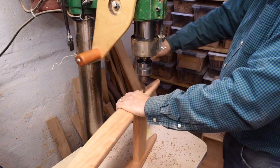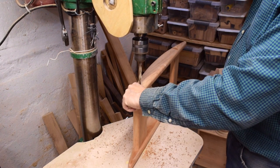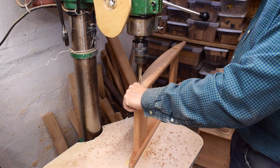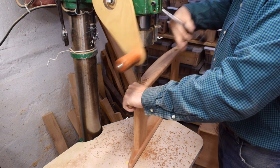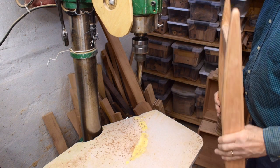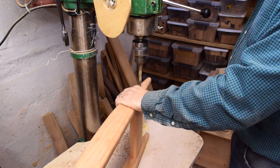After a couple hours, the glue sets up enough that I can bore the holes for the rocker assembly. I start out with one hole in each corner and drive in the dowels, then I'll add two additional dowels, making a very strong joint with the maple dowels I'm using.